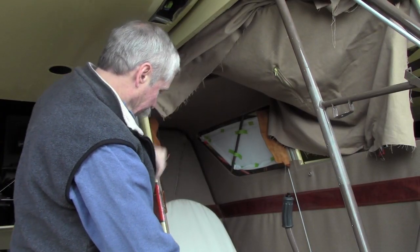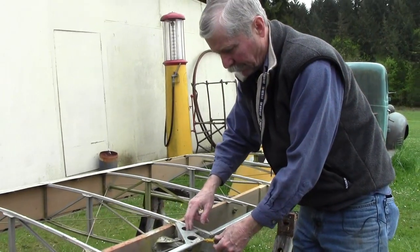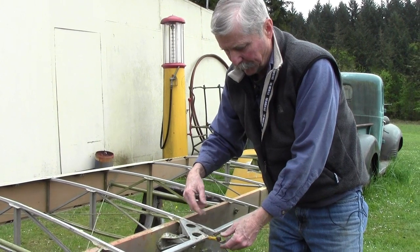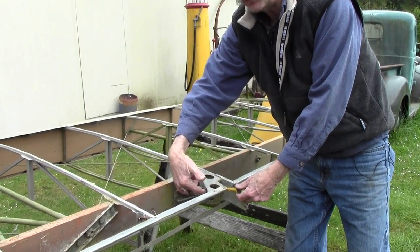Get your carry-through cable, interconnect, and that turnbuckle hooked together. The third step is to set up your aileron push rod and your bell crank, and you want those in neutral.